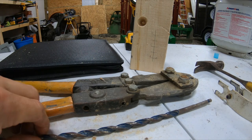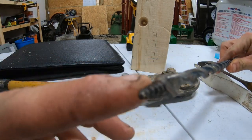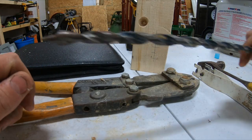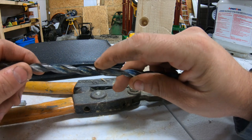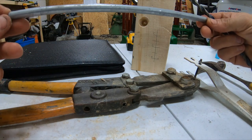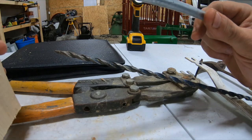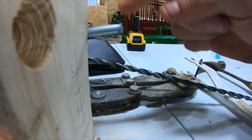You're going to need a 3/8" drill bit. I use an Irwin — it was a little more expensive than a cheaper one, but it's going to last forever. It just pulls itself into the post and cleans out very well; you don't have to jam it in and out. A lot of times you'll take a piece of black tape and put it on your drill bit so you know when you're deep enough for your brace pin. This brace pin right here would be one that you drive all the way through your post, and it'll be sticking through with the little end on the outside so you can put your wire around it.